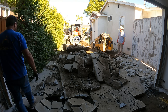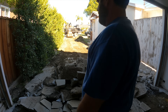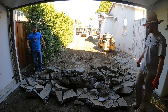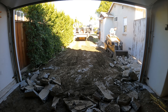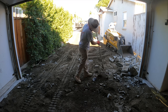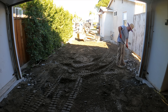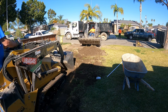We're taking a little dirt at the same time — every scoop is going to have some dirt in it, no getting around that. The concrete is coming out about three and a half to four inches thick and the elevations aren't going to change a lot. So I could either put base in and get it back to three and a half to four inches deep, or pour five and a half inches thick without base. My thinking is five and a half inches of concrete is better than three and a half inches with base — so I'm just going to pour it thick.